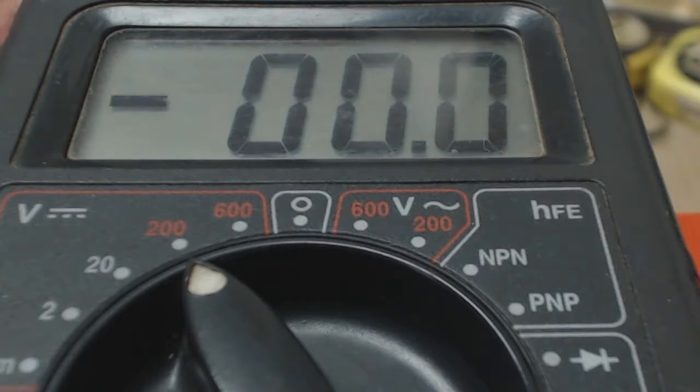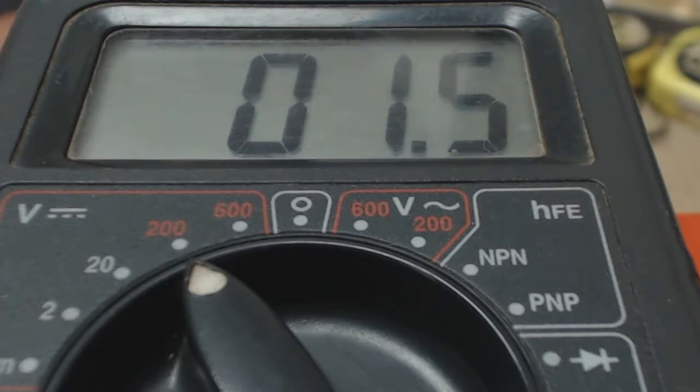There's a very slight buzz that the microphone perhaps isn't picking up — it's almost quiet. That's with the lamp out. Okay, let's meter it. I'm on the 200V DC range. You can see it's going negative and positive, and that's with the dimmer at maximum.